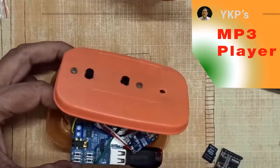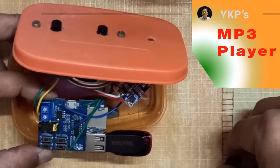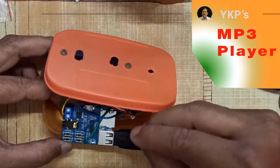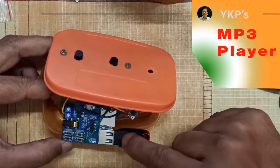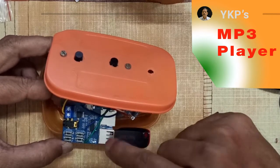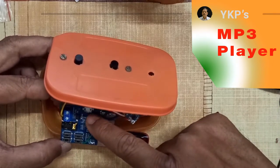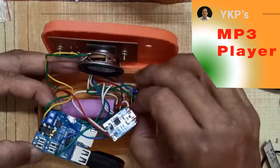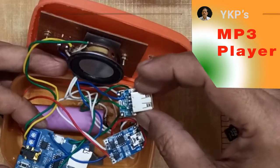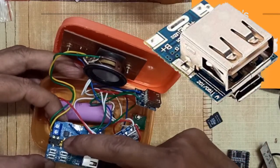Here is the MP3 decode PCB I am using. I have decided that at least my SD flash card is not at all reliable — it was not playing even directly with battery voltage. So I have decided to use the ESP USB stick. If I am using a USB stick I have to give 5V supply to this PCB. Instead of connecting a battery I connected the output from this 5V converter — if a battery is connected it can convert to 5V, and this 5V I am using to power my MP3 PCB.